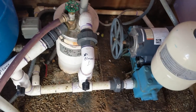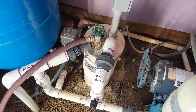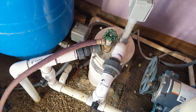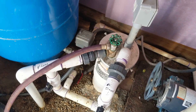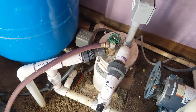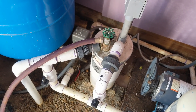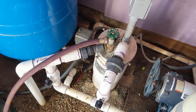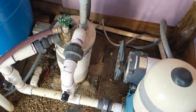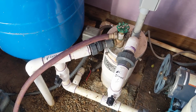We're going to rework all of this to allow quite a few things. Right now we're going to replace the small Sunrotor pump and put in an 11-gallon-per-minute unit — this thing only pumps three to four gallons, so we're going to 10 to 11. We'll pull that pump out and give them the ability to run the new pump off a generator, off solar, off the grid, and to pressurize the tank if needed. There's a lot of plumbing to be done so we better get to work.